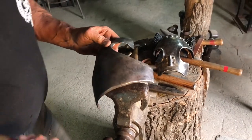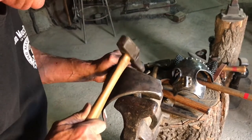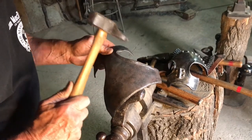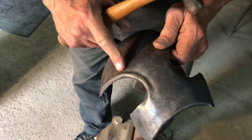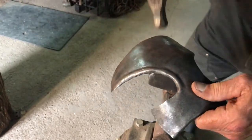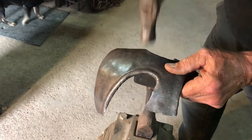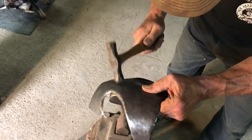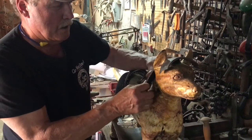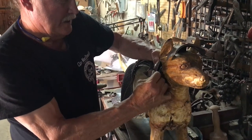I'm going to come in here like this. Now after the rollover and the offset, we're going to have a lot of little marks and bumps, and I'm going to planish the entire edge and take all these bumps out of it. So here is the new helmet, and I need to finish curving it a little bit this way here, and then we'll have it about where I want it.